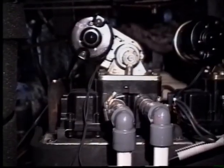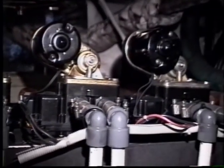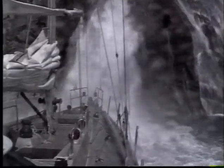There are diaphragm type bilge pumps in each watertight compartment. In the engine room, we use three so they can pick up water on either tack as well as when we're at rest. In the forepeak, we use a Y valve to convert the bilge pump for a washdown. Of course, if you're into real simplicity, you can wash the anchor down the natural way.